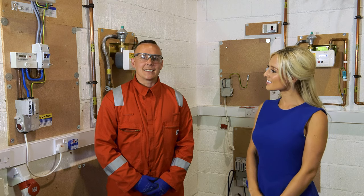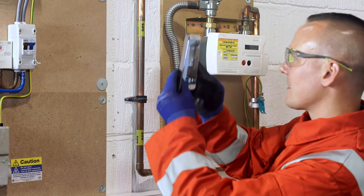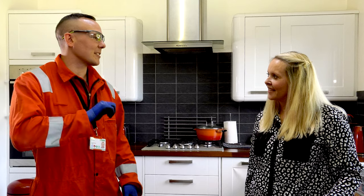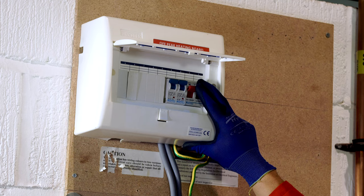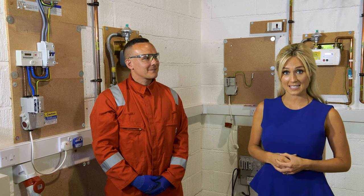It's a good idea to take a photo of the meter, cables and circuit boards, and depending on your company's procedures, you may be required to log their states. Ask the customer to turn their equipment off, and then ask the customer if you can turn the power off. When you do this, the buzzer will go off on the socket tester.